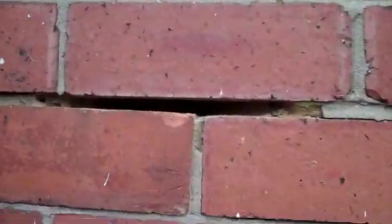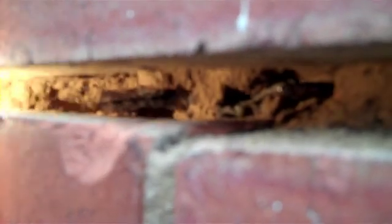So let's get to it and expose it. We've exposed this by chiselling it out in the bed joint here. It's a bit difficult to see, so I'm going to use the end of a boroscope just to light it up, see if you can see in there — it might be a bit difficult out of focus. But basically there's a very, very rusty wall-tie with lots of lamination on it, and a little piece of it came off when I chiselled away.